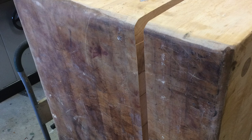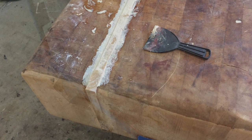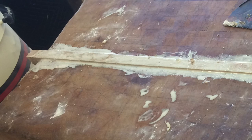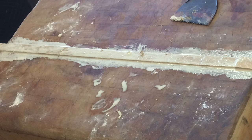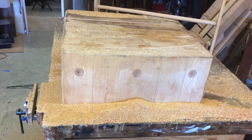One of the tricks we had to do here was make sure that our replacement maple boards had to go in with the end grain up. That's critical on a chopping block — you want to make sure you have the end grain up, because it closes up easier in the end. Here you can see we managed to get our groove cut. We filled it in with hard maple, cutting the groove to match the parts we had. We made sure the gap was completely filled with the end grain up.